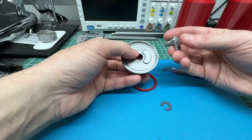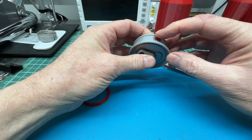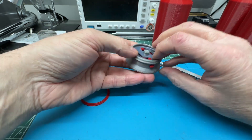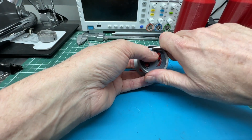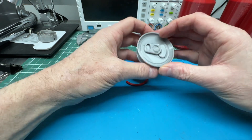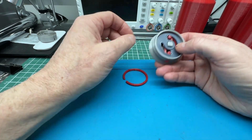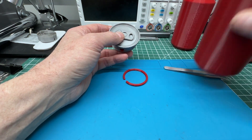You'll see it pop out the side — one on each side — and that's what causes it to lock. Then this cam plate drops in, put your finger on to hold it together, flip it over, and the part drops in. Make sure the tabs are out when you do this, and that it's sitting in the closed position. Then there's a split ring that holds it all together. At this point it's functional — press down, rotate to withdraw the teeth, and you can unscrew it.